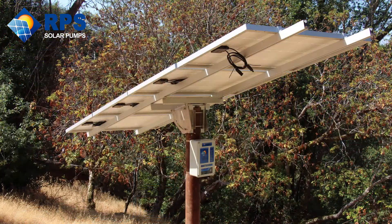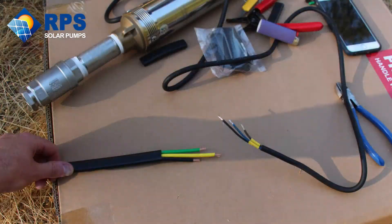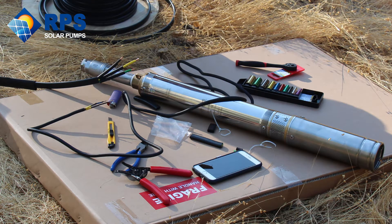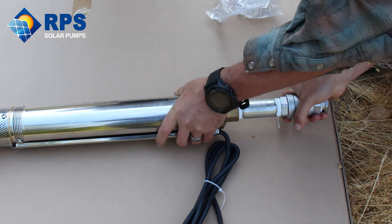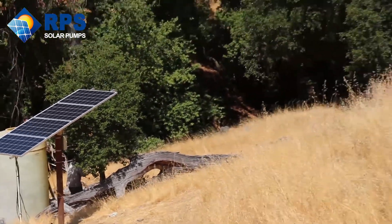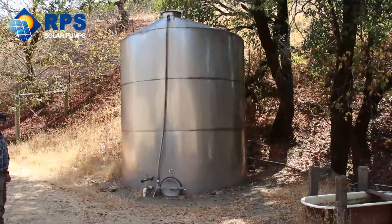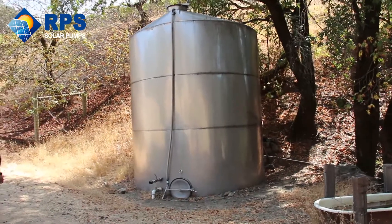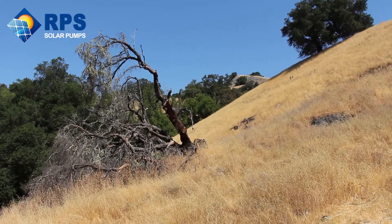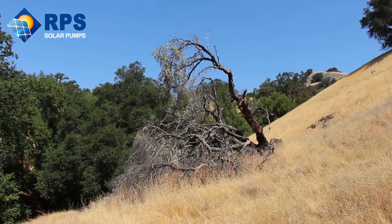It either comes with the RPS 400 or the RPS 400V. The V is our centrifugal — not quite as good on the pumping head, but really good on the volume. What they want to do is in the six hours of sunlight they get here, pump all the water out of that tank that collected overnight, and pump it way up the valley to a 5,000-gallon stainless steel storage tank about a thousand yards away and about 50 feet of vertical elevation gain. From there, they can use gravity to draw off the water anytime they need it and use it to drip irrigate their vineyard.